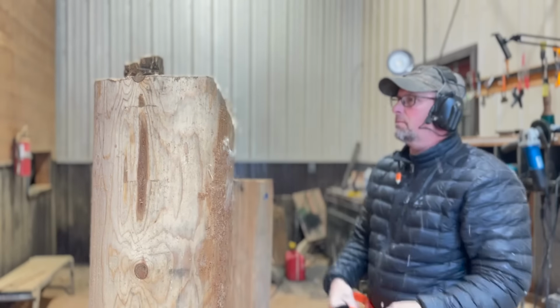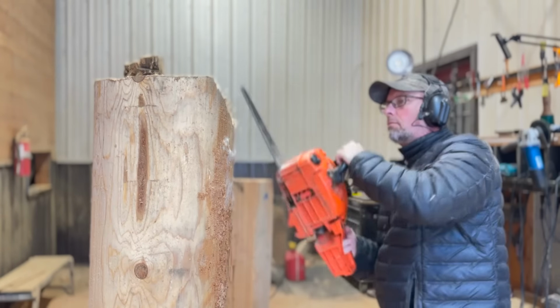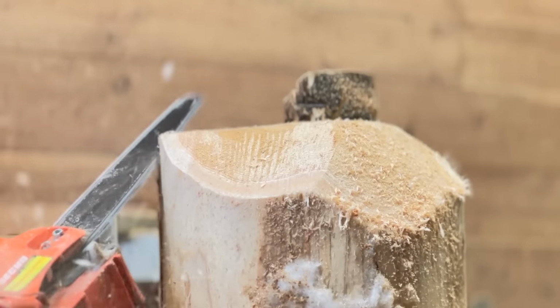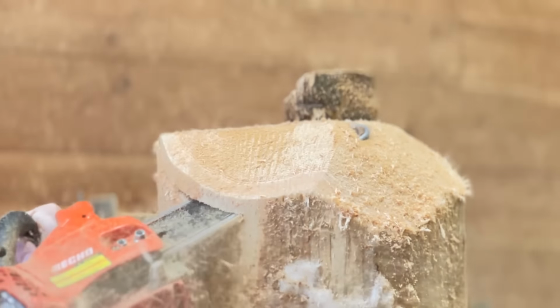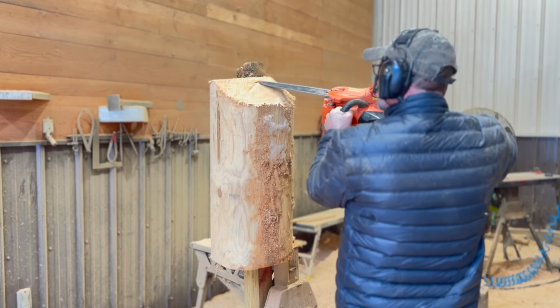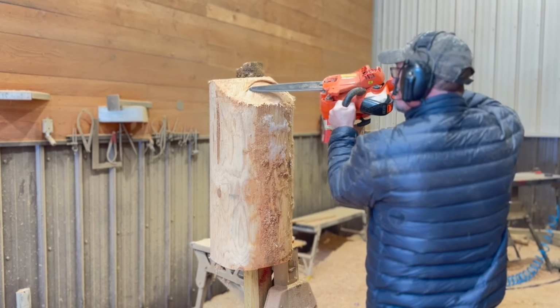When making these climbers, there's a lot of times where I pretty much make them for inventory with a 90 degree or square. So that's just like in the beginning of the video when you saw me using the square to make those perfect 90 degree angles and to cut them down. But you can always take those after you've done the carving and round those paws out to be a little bit more adaptive to a round tree scenario.